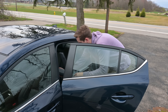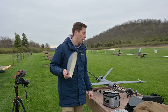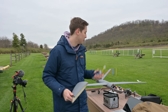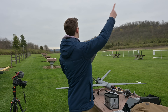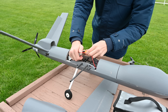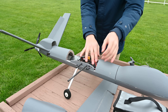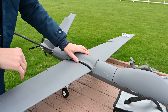The next day we had good flying weather, so I loaded everything up and went to fly it again. We've got the bigger 4,000 milliamp-hour 6-cell batteries, and the plan was to do big loops and see how long it flies. Because of how heavy the big battery in the front was, the plane ended up being pretty nose heavy, so I added another battery behind the wing to balance it out. This added a little more weight than I wanted, but I figured it could also help flight time.